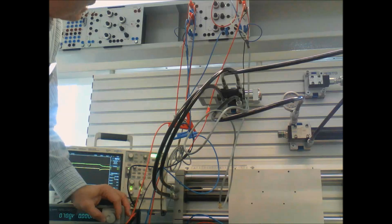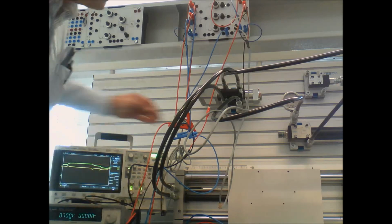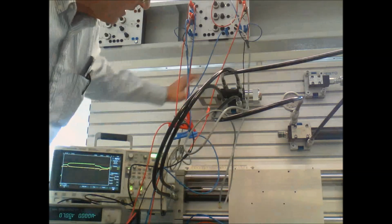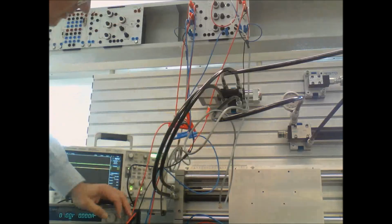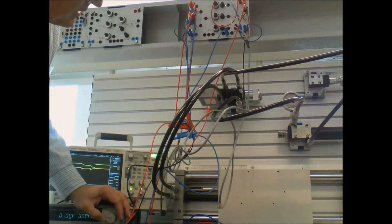So the proportional gain is behaving much like the integral gain would be if we hadn't had the integration going on hydraulically, because we have flow here, and this is controlled by volume. To get from flow to volume, essentially our hardware is integrating. So our straight proportional control gets us right where we need to be.